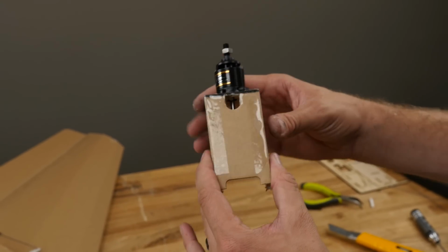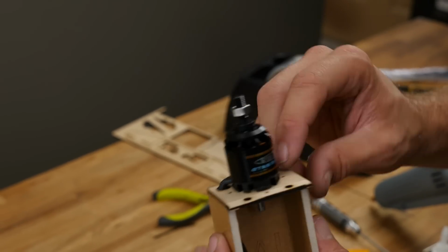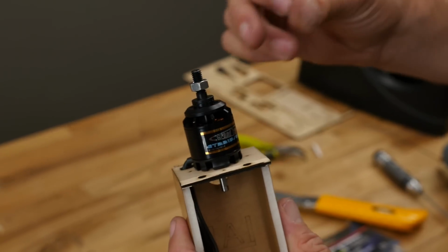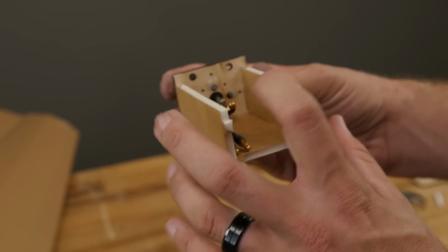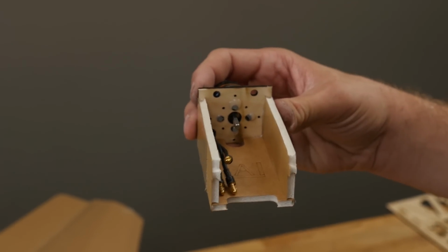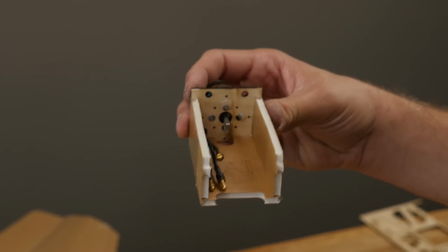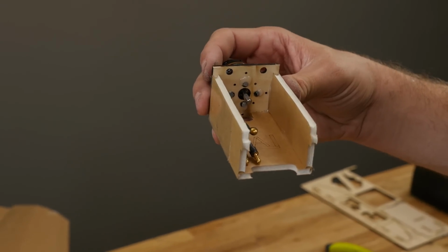The only difference is it's a little bit shorter. And the firewall is going to go on the side of the narrow notch. Another thing we did a little bit different here is you can do the traditional X mount, but you can also use the hardware inside of your motor kit if you're getting the C-Pack and actually screw it through the back. Now you'll see the 4 little drops of hot glue. That's because even though I use Loctite, I wanted to make sure everything was locked down nice and secure because this section is going to be very hard to get to in the future.